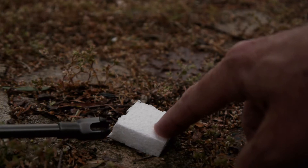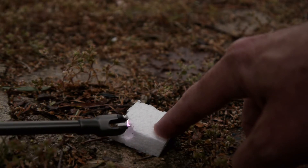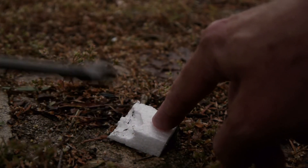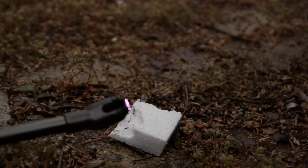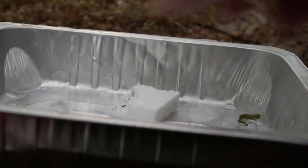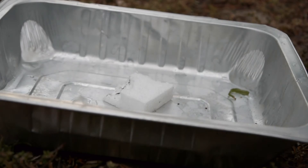I'm going to try and set fire to the polystyrene this way, and you can get it to start, but it goes off pretty quickly. What happens is it retreats. So obviously electricity like this is not really going to work. That means that, in my opinion at least, it's pretty safe inside your ceiling from any kind of electrical faults.